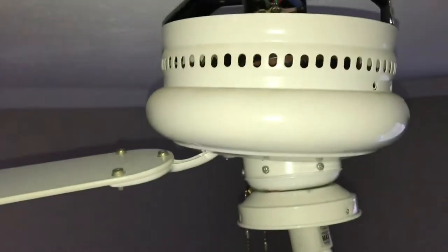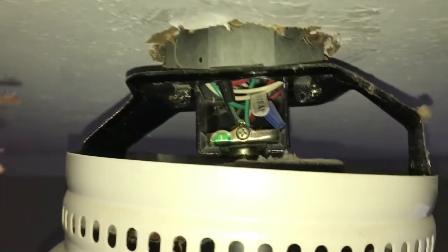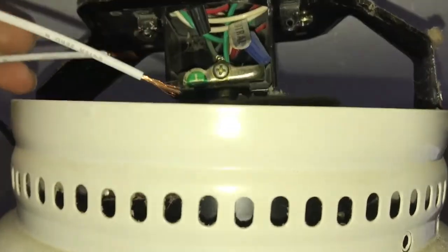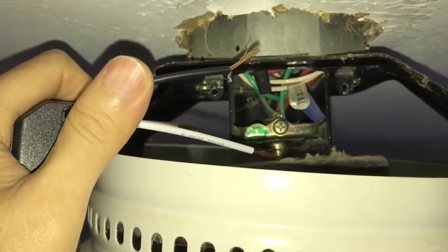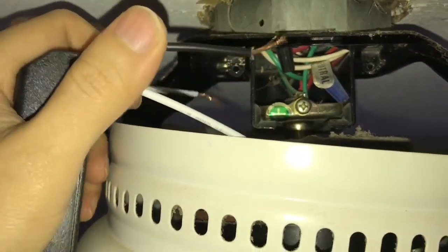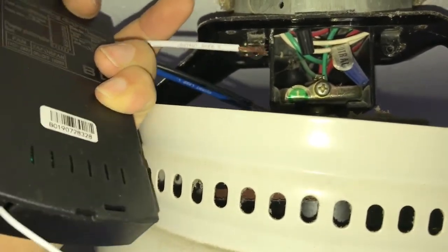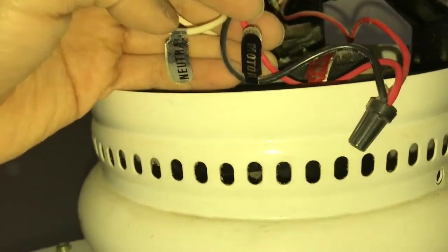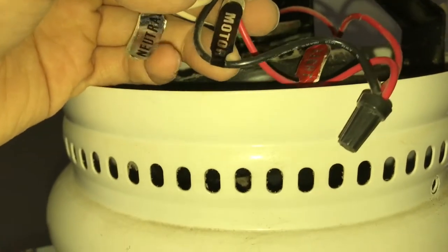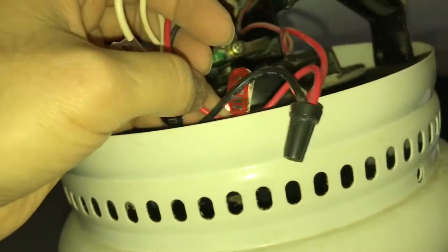So now after I remove two wings and the top cover, I am able to see the wire. Now I just follow the color wires — hot, neutral in and connect out. I will show you when I finish rewiring. So this is the neutral for the fan, this one is the hot wire for the fan. And instead of the blue, they have the red one for the light. You can see the light label right here.